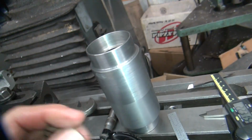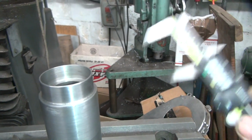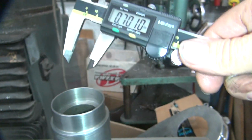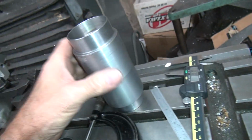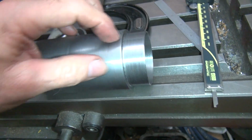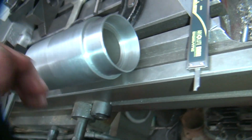So I've got 100 thou of material to work with because we went down 700. Looks like we didn't quite get 700 down though. Looks like we only got 650 down. That's not good. Yep, 700, good. The hacksaw blade is 60. And as long as I cut next to this edge here with the bandsaw, it should cut pretty evenly. So we'll have to give that a try.